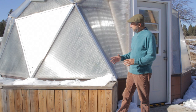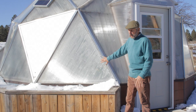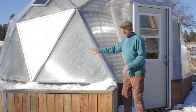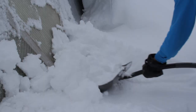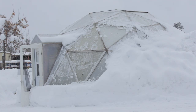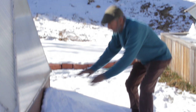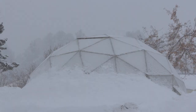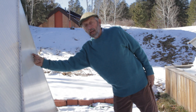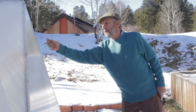If you don't get a lot of snow, you might want to put an outer garden bed on the outside of the dome wall for added insulation against frost penetration. However, if there's a lot of snow, it could build up on the bed and block solar gain through the glazing, so you'd need to keep it shoveled. On the north side, you actually want snow to build up — it acts as insulation. Snow building up against the polycarbonate is very acceptable and doesn't increase the snow load, because heat coming out of the dome melts a minute air space right at the dome surface, so the snow doesn't bond heavily to the structure.